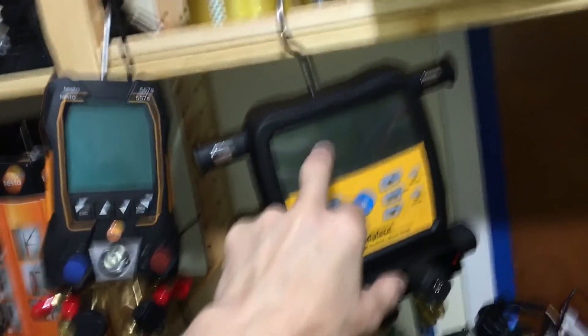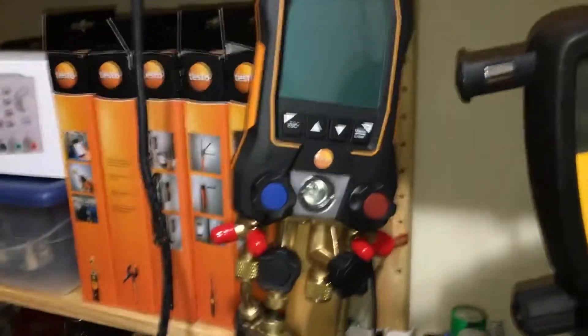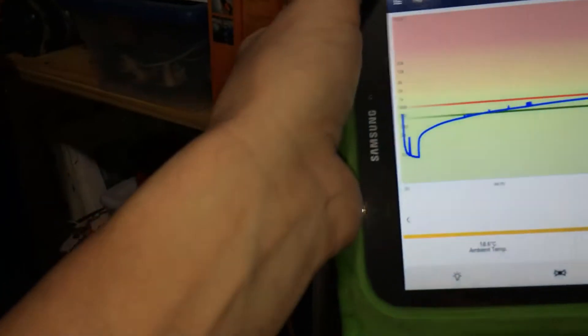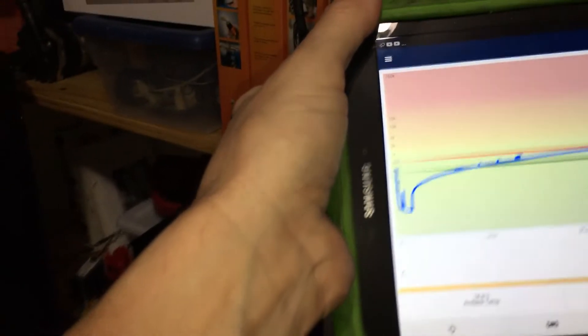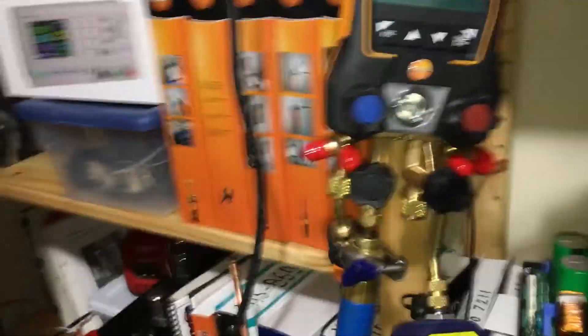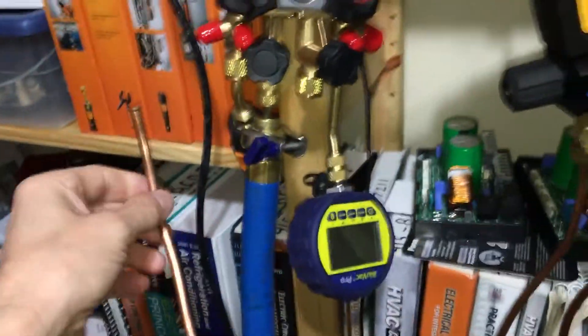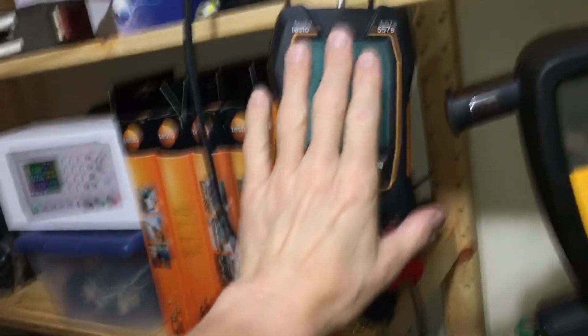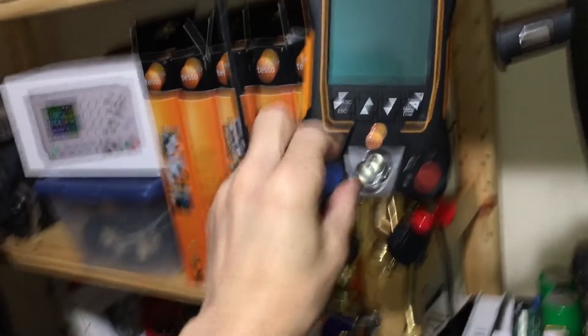Actually, from the very last video about a month ago, I turned this off under a vacuum and when I turned it back on - after almost a month - it was still at 800 microns, holding a vacuum inside itself. That tells you just the manifold itself is capable of performing a vacuum decay test. I would give it up to four hours at the 200-micron point as being good, and if you did a vacuum decay test with metal lines - not rubber hoses - you could reliably say the gauge itself is not adding to your decay.